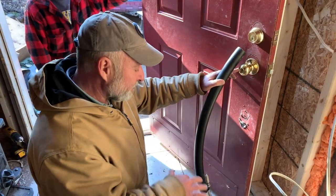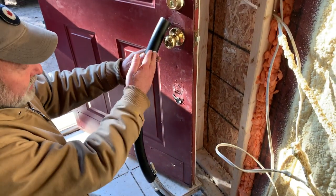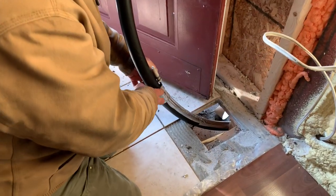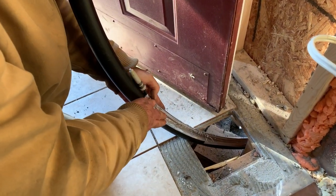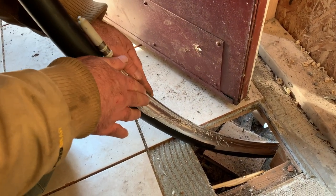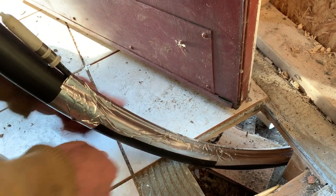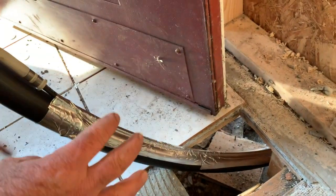Here we are inside the building where this water line is going to go. An inch-and-a-quarter pipe is coming up through — there's lots of extra here for making connections to the internal water system — and this is the end of that heating cable. We've applied it to the outside of the pipe with some pretty thick, heavy-duty aluminum tape. It forms over and holds the cable tight to the pipe along its whole length, and it also helps to conduct heat over the pipe as well.